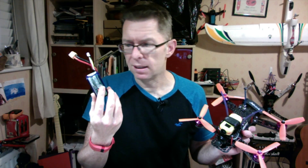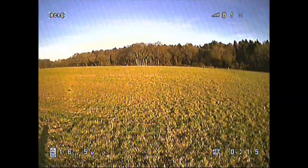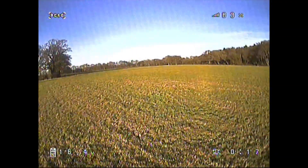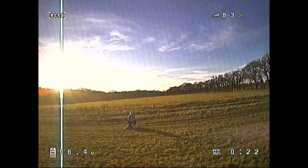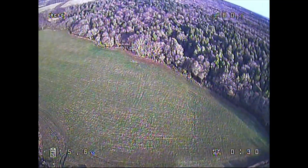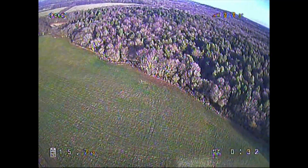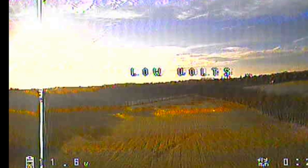Let me show you a bit of this just to show the demonstration of how it sagged the hell out of my LiPo, which is normally absolutely fine when I fly my quads with it. So in this clip I've just taken off and I wanted a full throttle punch out to see what would happen. I get pleasantly up in the air. But what did it do to my battery? We punch up and if I stop it - down to 11.6 volts from 16.8. Oh my God.